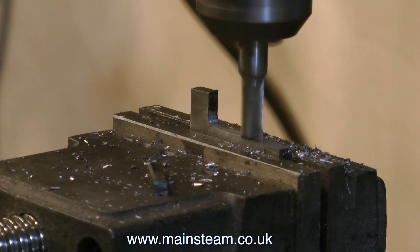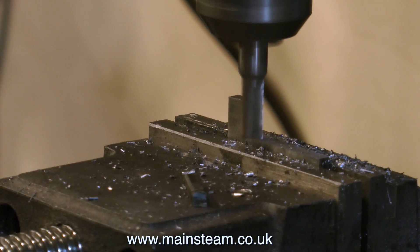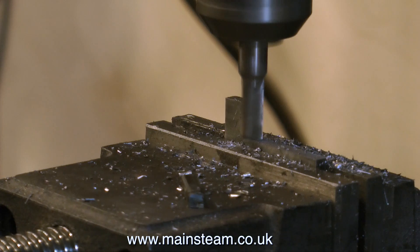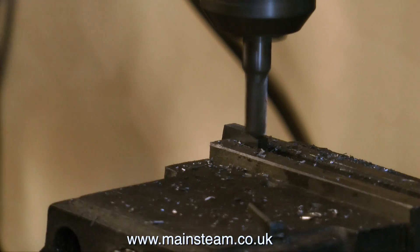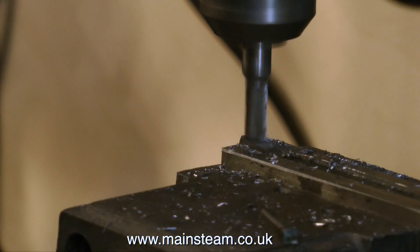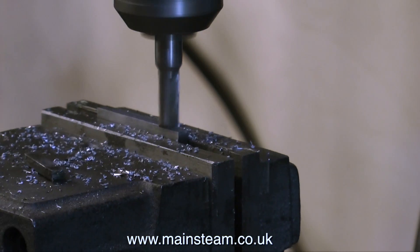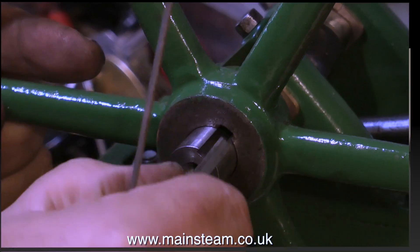This is the first of the finishing cuts on the milling machine on this flywheel key. I originally cut the key from a larger piece of steel, which was held horizontally in the milling machine. The milling cutter left a radius profile at the front of the key, which needs to be removed — this part needs to be exactly at 90 degrees to the front face of the flywheel. I've now turned the part over in the milling machine to mill an angle on the outer part, and once it's cleaned up on the linisher, it looks like a keyway key.